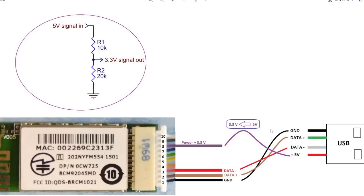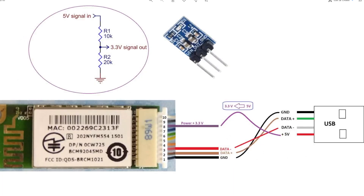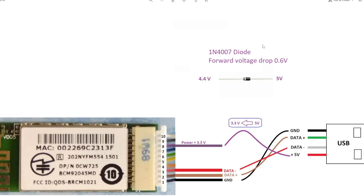There are a few ways to reduce from 5 volts to 3.3 volts. One option is to use resistors, but they said that once a load is applied, the voltage drops further and it won't function well — so I abandoned that method. A good option is to use a buck converter module for stable voltage, but I don't want to buy a new one because this is a recycle and reuse project. So I chose to use diodes, harvested from a malfunctioning DVD player.